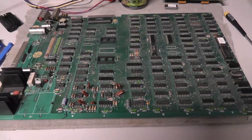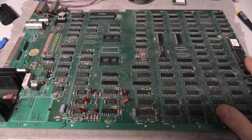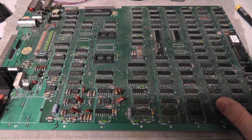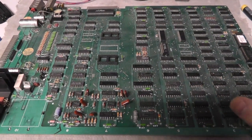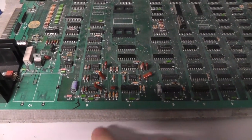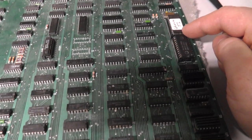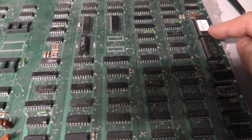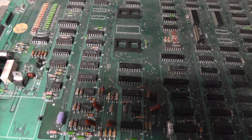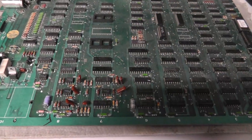Back with another video doing something a little different. This is a Galaxian board I picked up — two or three non-working ones. I wanted to take a break from my Missile Command so I put this on the bench. It was missing at least one ROM and I burnt that. It doesn't have the daughter board, so I'm actually going to make this a four-in-one and eliminate the daughter board.